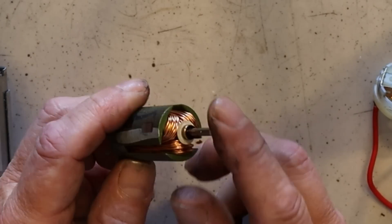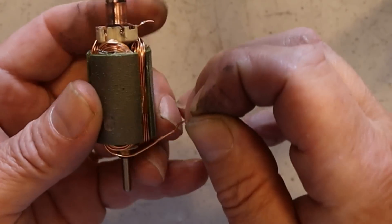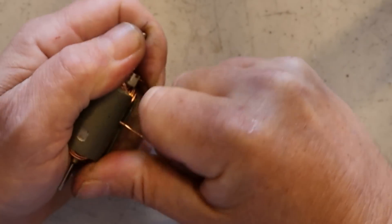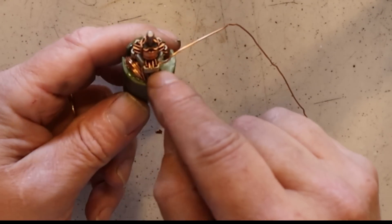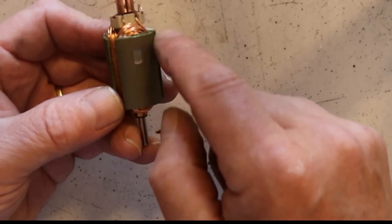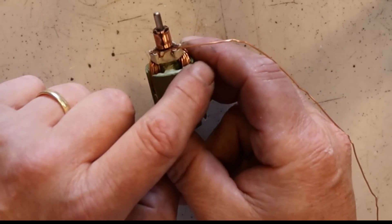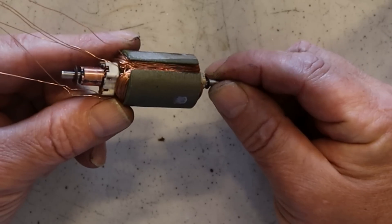So what we're going to do is rewind this rotor. As we follow the wire we can see it begins there and unwinds in an anti-clockwise rotation, which means it was wound clockwise. When you've unwound it, it goes into that section of the commutator — there's a clip on this — and then it comes out, and again that one has been wound clockwise. So: start point, turn clockwise into the clip, out, turn clockwise into the clip, out, turn clockwise and finish. There are 24 turns of 0.6mm gauge wire.